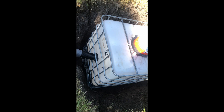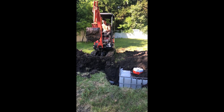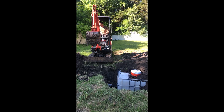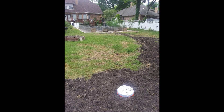For the access port to drop the pump into, I wanted to use a 12-inch PVC pipe to look more professional, but that wound up being really expensive — like $150 for just two or three feet of 12-inch PVC and a cap. So we got creative, went to the hardware store, and found a little Gatorade cooler for about $20. We cut that in half, and that gave us a great access port on top of the tote to drop the pump into. Then we buried everything with the excavator, and what you're left with is just this one little access port sticking out of the grass that you can unscrew, drop your pump down in there, and run the hose three or four hundred feet away.